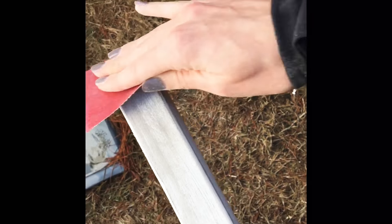Next, I'm using a white chalk paint leftover from several previous projects. I let that dry, then took 120-grit sandpaper and gave it a light sanding, applying more pressure to the areas where I want them more distressed. We'll actually be using this as a towel rack.